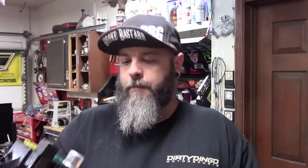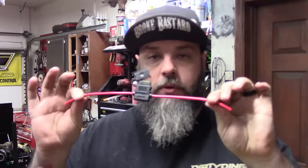I bought what I thought was a wiring harness, but it turned out to be a fuse box with leads on it — not sure how much I'll use in the car, but it'll give me fuses to break the line to the relays. In this instance I'm just going to be using an inline fuse. This is great when you're adding something to the circuit and don't have room on your fuse panel — just put an inline fuse in. This is the most common way I do things when adding to a vehicle.